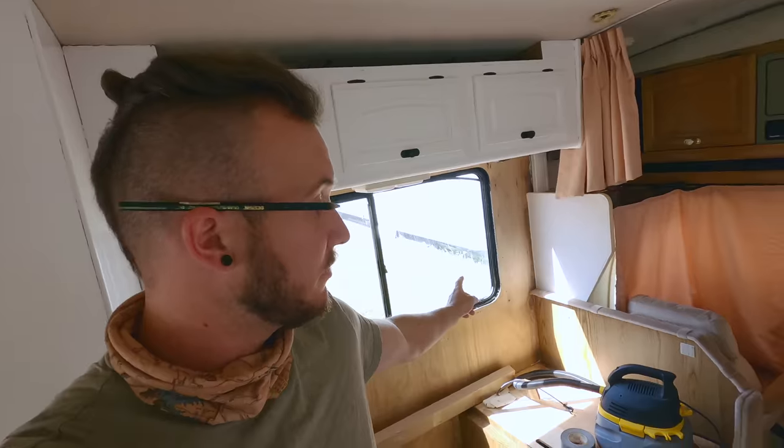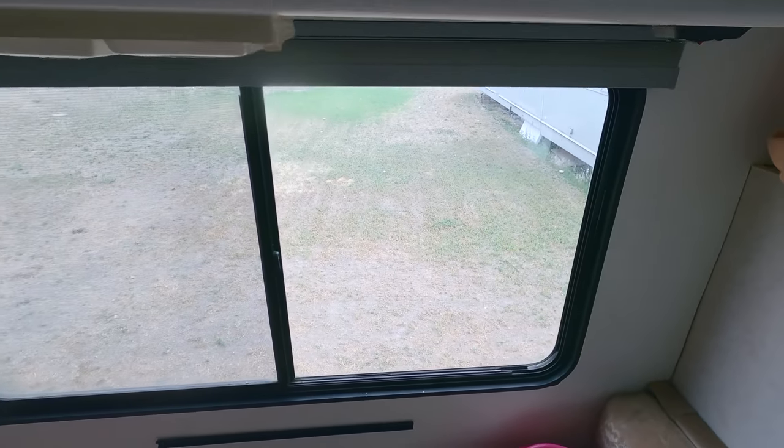I'm pretty happy with how it came out — it was a lot of work, about a day and a half. Today I tackled the remaining wall, and just like that it was finished. It's called Poly Wall — it has the texture of painted wood but it's waterproof, wipes clean, and is super durable. I stuck it on with FRP adhesive — fiberglass reinforced adhesive — troweled it on and put it up. It was hard to vlog because I needed both hands and it was time-sensitive since the adhesive starts to dry fast.